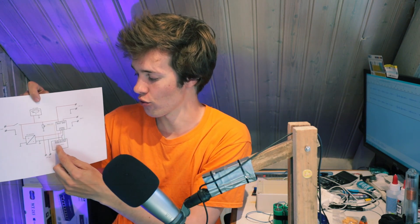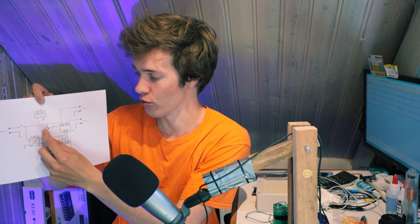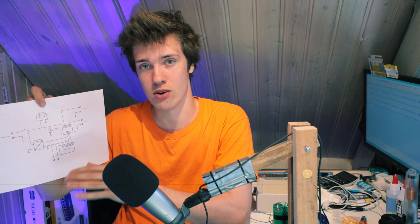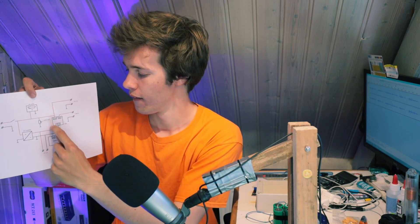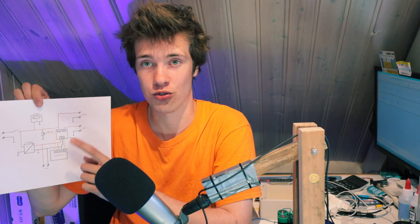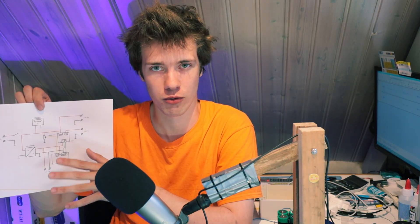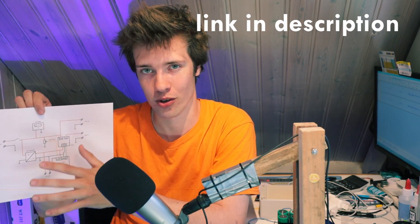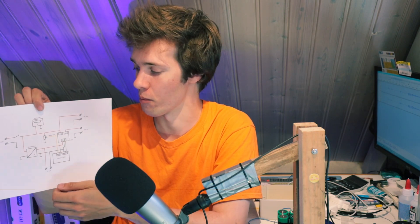What's going to happen is this Arduino is monitoring the battery's voltage through the sense wire over here. And once that voltage reaches a certain level — in other words, when the battery is fully charged — the Arduino is going to turn this relay off and disconnect the solar panel from the battery. So that prevents the battery from overcharging. I'm going to put this diagram on my website so you can have a close look at it yourself, along with a couple of recommendations for some things you might want to change about this if you want to build this yourself.